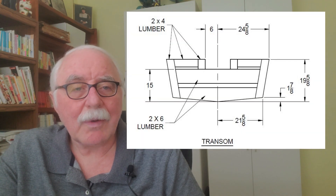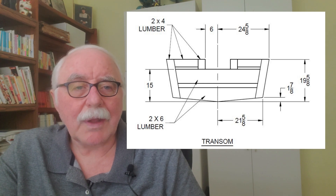The Japanese motors are about 17.2 inches. For most of my boats, I say to make the transom cutout dimension 15 inches — but that doesn't include the planking. If you put a half-inch wood on the bottom, run the cutout at 16.5 inches, add the half-inch planking, and you'll be at 17 inches — the ideal size for a modern short shaft motor.